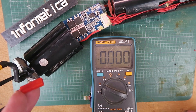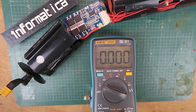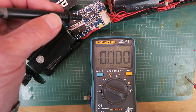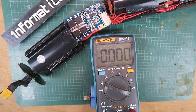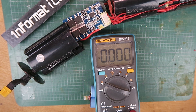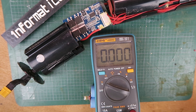It's been a few hours now, I've disconnected the charging port. I'm not seeing anything on the output connector. If we remember from the battery label, the low voltage cutoff was at some 20.5 volts, and the pack is now measuring 28 volts. In theory, then, we should have some output here. I guess there are two possibilities at least: one being that the BMS is faulty, or in some cases I've heard that there is some kind of signaling that comes down from the controller to activate the BMS. The next thing I'm going to do is to hook up the controller and see where we go from there.